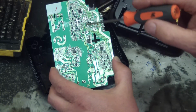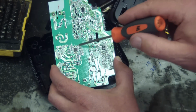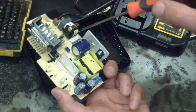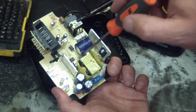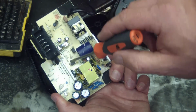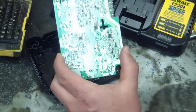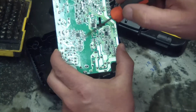I might have glossed over this, but the little brain box here, is it this guy? No, LM. Some of these are battery controllers. There will be one main microcontroller, and we don't want to fry it, so it turns these guys off and on. It puts power to the gate on these guys through these opto isolators, and in here is actually an LED and a receiver. There's no actual electricity going between here and here, because if something happens with this, it would fry it.